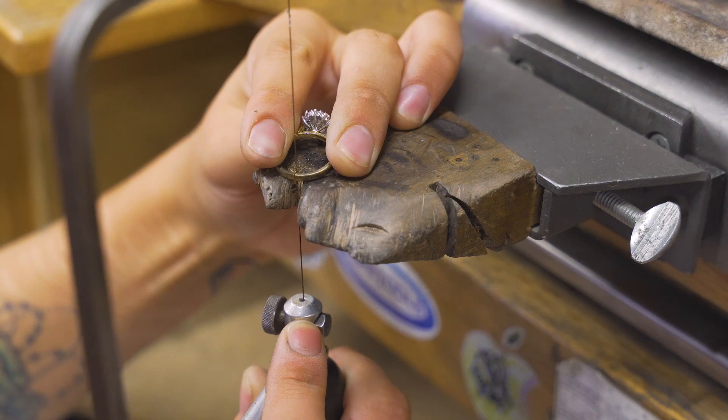That's exactly what I've experienced from work coming back to my workshop — they've obviously used the laser, it's cracking and breaking. With the V-filing technique you're referring to, that's a completely new concept to what we would typically do on the bench, where we want to butt things right up against each other. So that makes sense — thank you for the clarity. We'll cover this in our workshops. Paul will get participants around him, tap it up two sizes, and it won't crack. If you've been scared of sizings because of brittle joints, this is exactly the technique.